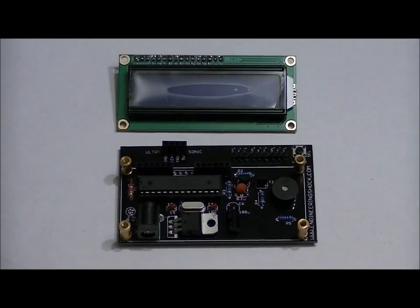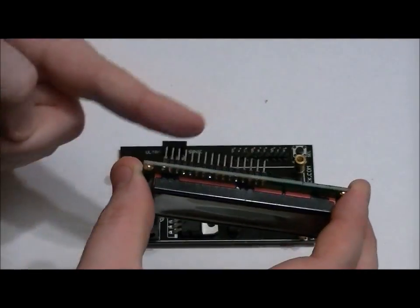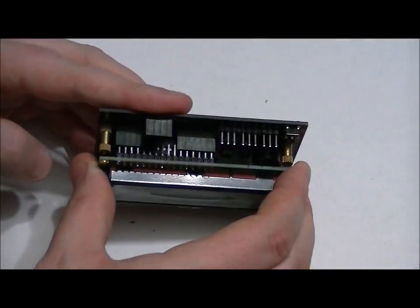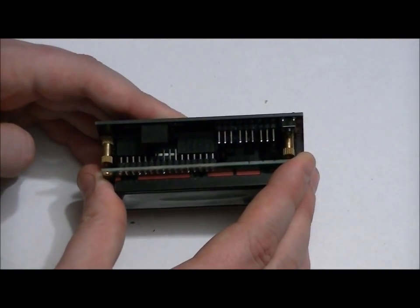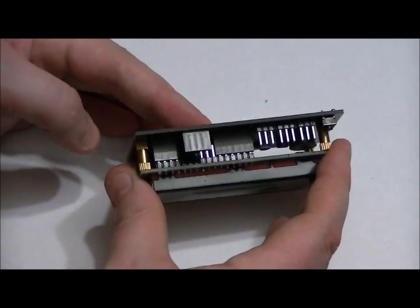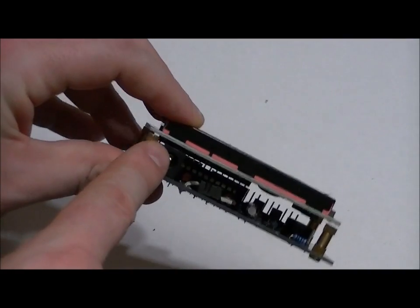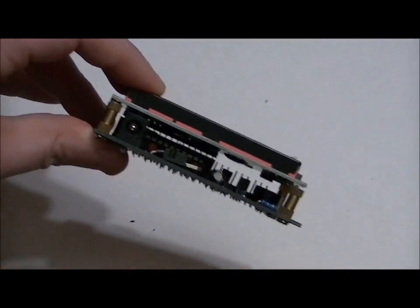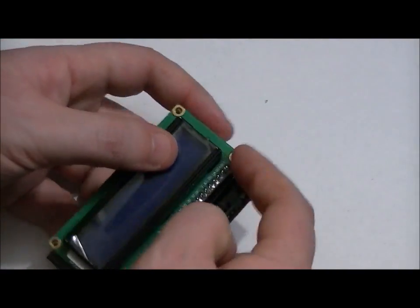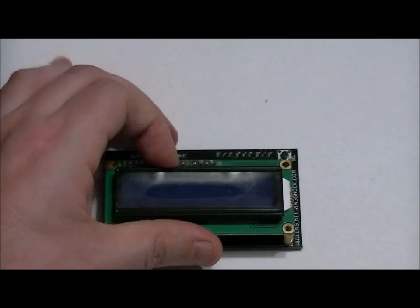With the LCD ready to mount, the end goal is to take the rightmost six pins and leftmost six pins and place them face down, carefully, lining up with the two 6-pin headers and fitting it in. Now, what you'll notice is that there's a little bit of an obstruction here. You don't have to do this next step. It's up to you. If you want to skip it, you can just gently place your other three or four M3 screws in and just don't tighten too tight.